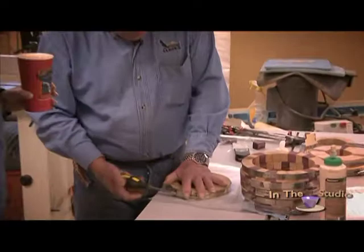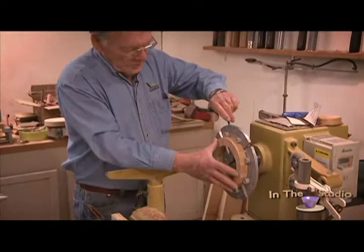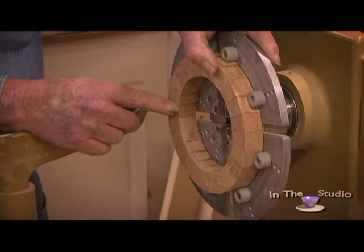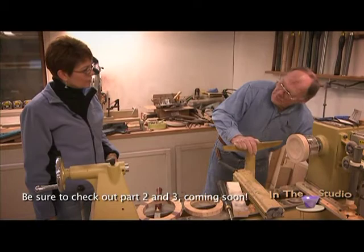We're going to unclamp the first piece since the glue is dry, then go over to the machine and surface off both sides so we can glue it to our bottom. With all these glue joints this becomes an exceptionally strong piece — it's called a laminate, and when you glue the flat surface it becomes even stronger.